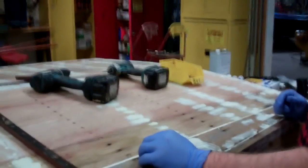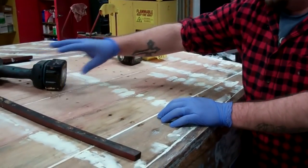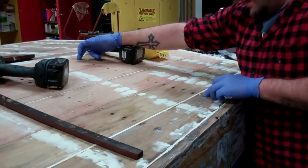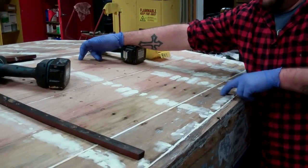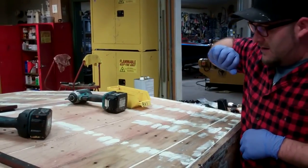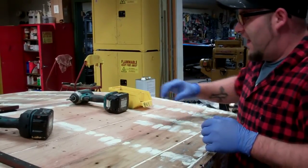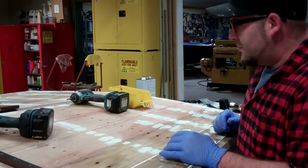Joe, why don't you talk us through the process? So right now what we're doing is we're pre-fitting them in before we slather the bottom side with 5200. RJ is underneath and he'll take the batten and line it up where the screw holes were. We'll pre-drill down through it so that when we're trying to fasten the batten to the boards, we're not fighting each other — RJ has to push up while I'm pushing down on the screw. When it's pre-drilled, it's a lot easier; he doesn't have to put as much pressure and it tends to fall into place a lot better. So RJ is underneath there now and I'll have him get the batten up and get the first two pre-drilled.